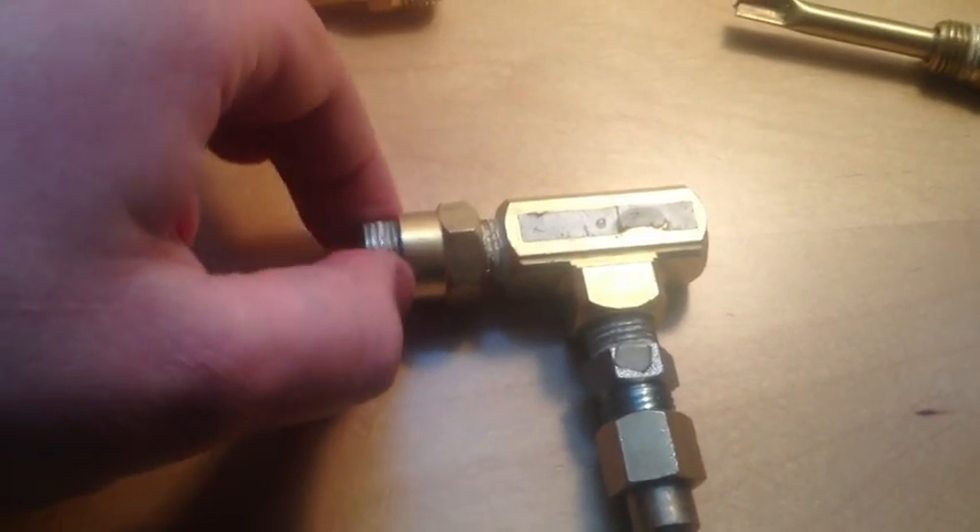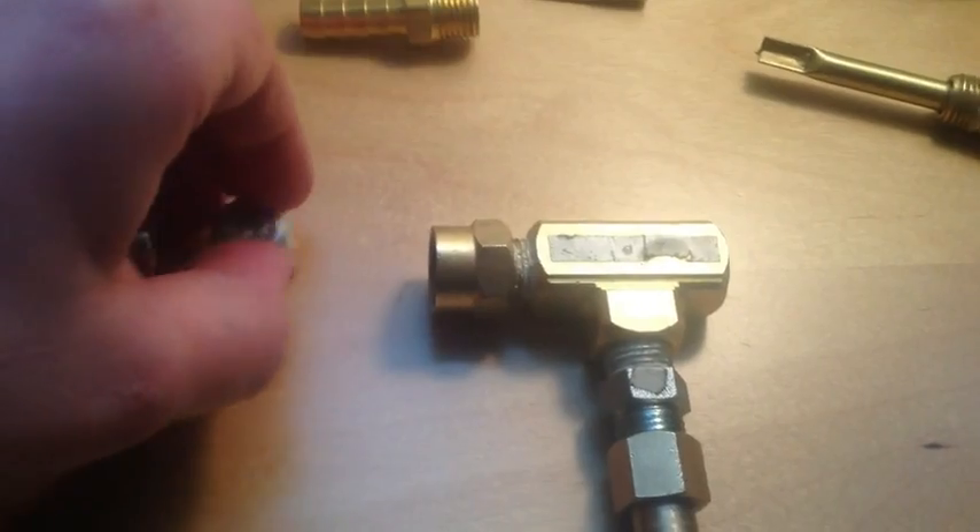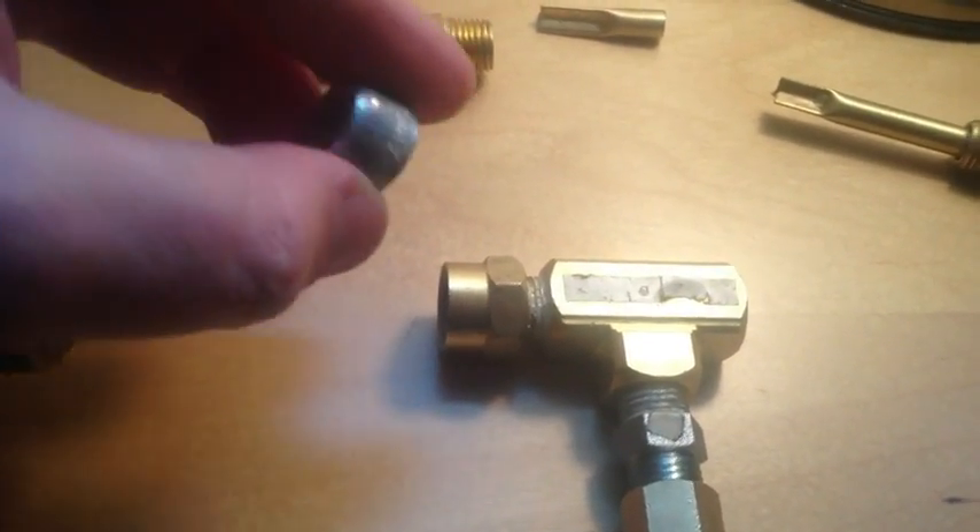Now I'm going to talk about the plug. I took the plug and drilled a hole right through it. Looking at a close-up, you can see I drilled the hole right here and also drilled around it, so that it can fit inside there really nicely and the air can pass through it a little bit better to atomize even more effectively.